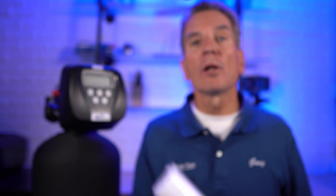The cheapest way to remove dirt from your water is to use a simple sediment filter like one of these — polypropylene filters available in different microns. You can go with a coarse one at 50 microns, or finer ones at 5 or 1 micron. There are also great dual gradient filters with a coarser filter on the outside and a finer filter on the inside. I'll put a link to a video in the description below where you can check that out.